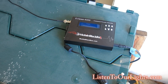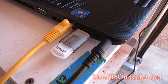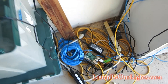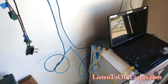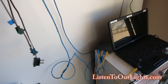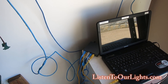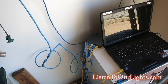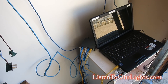Here I have my radio transmitter — it's the Eclipse 4000 Mobile Black Box, hooked up to the 3.5mm audio out jack. When I'm running off the Pi, I hook it up to the Pi. The computer and the Pi are both connected to an Ethernet switch, and then I have three other devices hanging off of it — my three pixel controllers. I'm not running any Light-O-Rama software whatsoever, just the xLights scheduler. The sequences were written with xLights 64, and I transfer the FSEQ files to this machine. It communicates via DMX, which is E1.31 over Ethernet, to the three Falcon controllers.